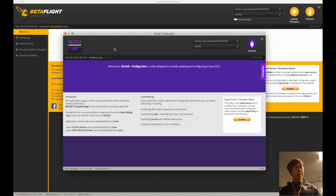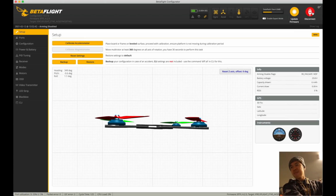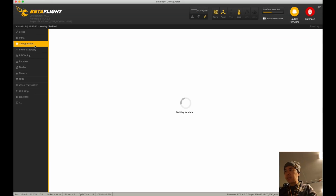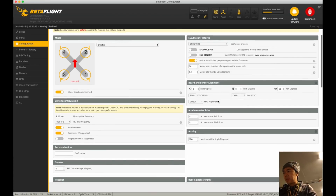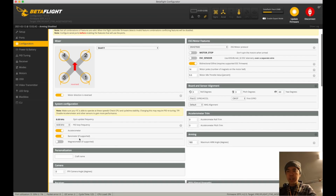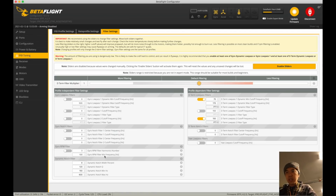going to now go over back to Betaflight. Now what we're going to do is enable RPM filtering, and you start off by going to configuration. We're going to enable bidirectional D-shot. We'll click save there, and this is an F7, so I should be fine running an 8K and D-shot 600 setting here. Then I'm going to go into our filter, enable Gyro RPM Filtering.